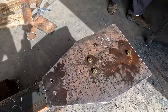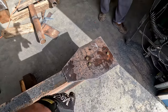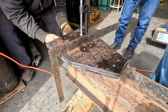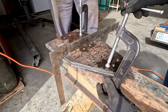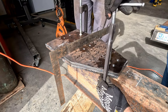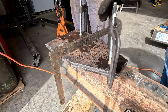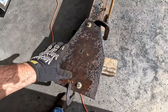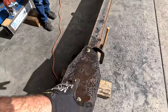Got those holes drilled — those are all half-inch grade 8 bolts. I think we're going to use this for a template and drill the other side. Finding our beam is about a sixteenth of an inch narrower on this end for some reason, so we're going to adjust accordingly. We'll put a clamp here and use our half-inch drill to give us a center using this as a template. We got all those drilled — half-inch bolts, six of them. I think they're going to be fine.